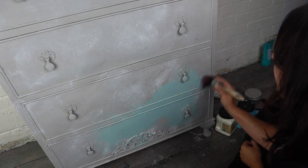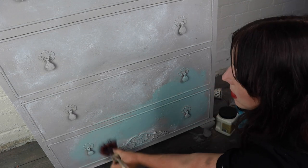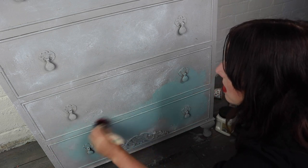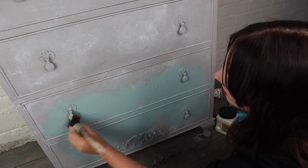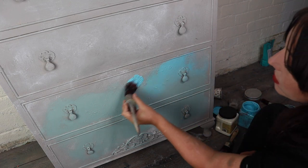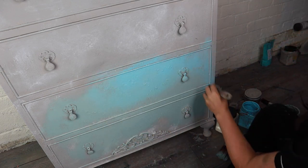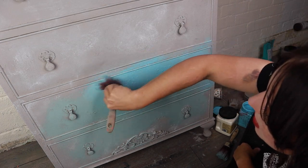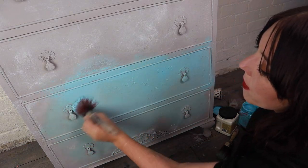I have three colours. The one I'm starting with right now is Vintage Duck Egg and I'm using the oval medium brush, with a brush for each colour. You will feel like the paint brushes are really dragging and that's fine — that is supposed to happen. The reason is because we've got resistance from the texture and the sea spray, and also some resistance from the wax. If it's dragging a little too much, just wet your brush a little or give it a mist, but don't go too crazy with the water because we want a really old world style here.